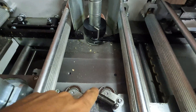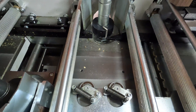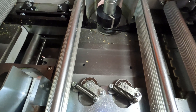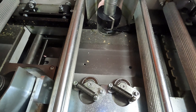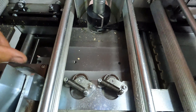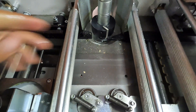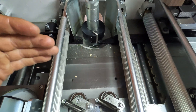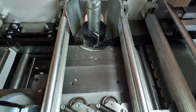Across from that you have pressure rollers. Pretty much everything in this machine adjusts for whatever you're making because there's such variability between different things — between flooring to crown molding there are huge differences in how this machine gets set up. These pressure rolls put pressure on the board and hold it against that side of the machine into that cutter head, because every time you're cutting something that cutter head is trying to push the material away from it. So that counteracts that force.